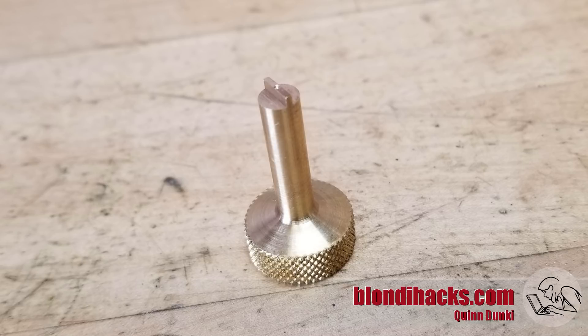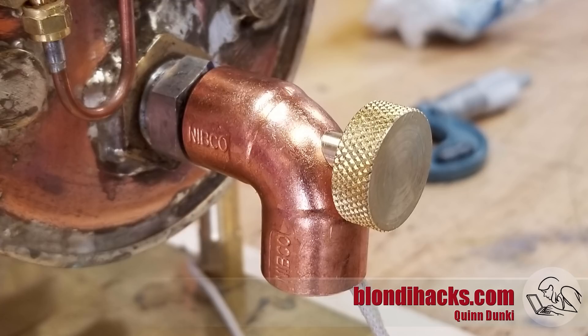Here's the final knob — it's looking pretty sharp. You can see a little remnant of the center hole from earlier, but I'm otherwise pretty pleased with how it turned out. And here's the final result. You can see how the knob goes through the elbow and keys into the thermo switch inside. Intentionally there's a bit of an air gap between the thermo switch and the elbow, because I don't want the heat from the boiler — which is considerable — to conduct back into that elbow any more than necessary, as that could potentially overheat the wiring.